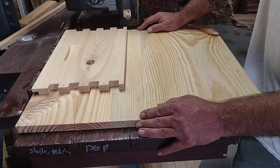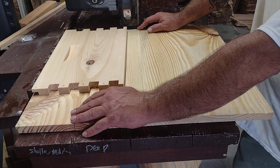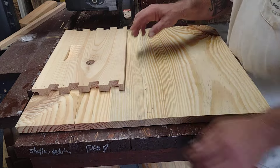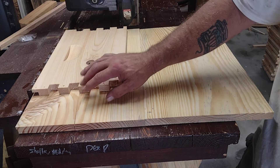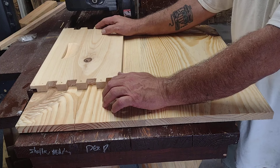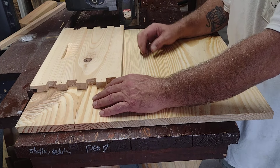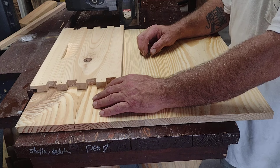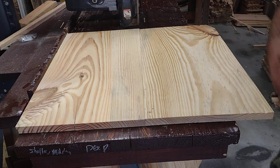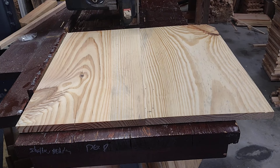I'll start two stacks now because I've got to split the boards — half of them are going to be long sides, half are going to be short sides. When I run across something like this one here, I'll go ahead and cull it off to a different stack so I know it's a short side, then I'll put my long sides together. That way I'm saving time on what I've got to cut. So that's what we're going to do now — ripping them to width.